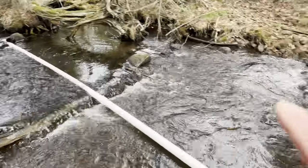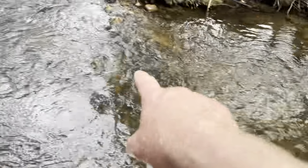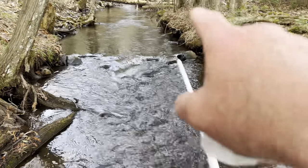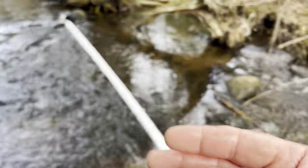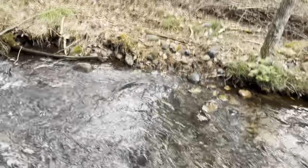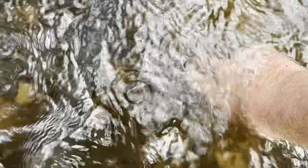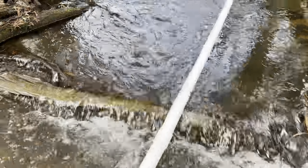All right, I would say that we're in the hunt. I've got my Y pipe all filled up with water, and I checked the suction on the top end right there, and that baby pulls your fingers in there pretty good and tight. So there's plenty of suction up top. Now this one here, it didn't have very much at all. You can barely feel it. I don't want to take it out of the water, but there is a little bit. It'll pull your two fingers towards it, but not nearly enough to what we need.